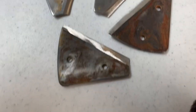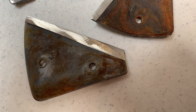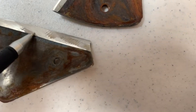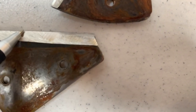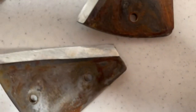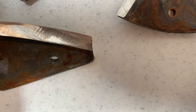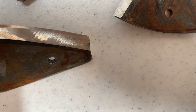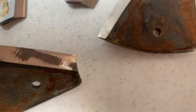We're going to look at each one of these four blades and I'll try to tell you what's wrong with them. On this edge, you can see that it's coarse. Coarse itself isn't necessarily all bad, but when you're coarse down here the little teeth are going to be a bit weak and want to roll over. See how ground up that is. And see on the edge — I'm getting the light to glare on that edge where it's done really steep. The person who did it wanted to get it feeling sharp faster, so they increased the angle. Well, that's bad. That makes a mess of it.